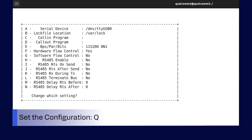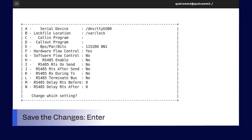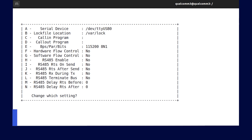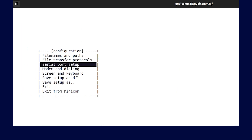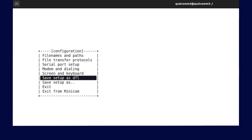After that, press Q on your keyboard to set the configuration to 8N1. Now press Enter to save the changes. Press F on your keyboard to set the hardware flow control to no. Keep in mind, all the letters here should be in caps. Now press Enter to save the changes. You will see the configuration menu again. Select the save setup as DFL option and press Enter to save the configuration. Your UART is now set up.